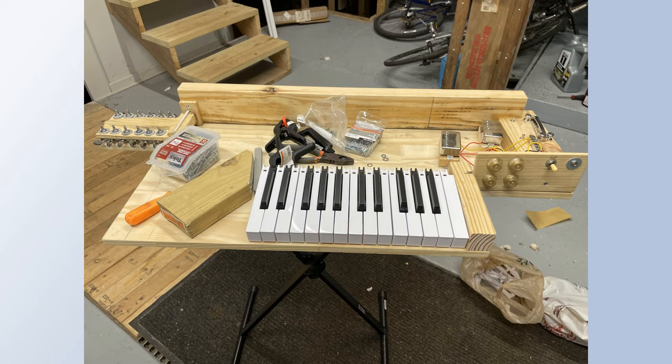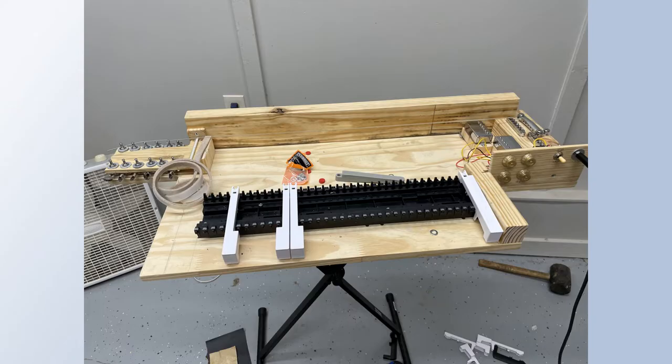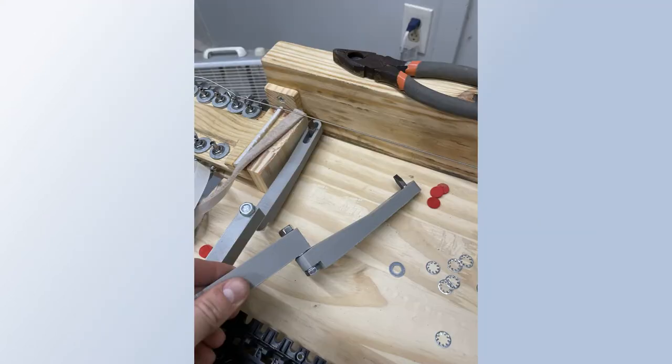The four-octave clav would have required some sort of custom-made strings, as it was too long for guitar strings. In order to make the project as a whole more manageable, I cut off an octave and opted to use guitar strings. At this point, I simply worked key by key to achieve the correct fretting until I was unable to use the 3D printed parts, as the frets got too close together.